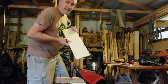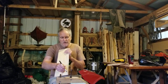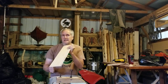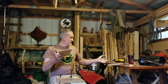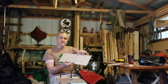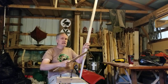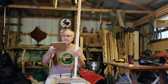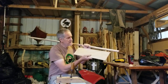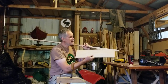Remove the strip and you have a nice smooth curve. If there are any kinks in it, clear them up after popping the nails out. Rough cut to the line, cut that out, and sight it and sand to refine that curve. You can also refine it once it's on the bow - sight down your bow to check for discrepancies. You can make handles, limbs, or anything using that method - just a thin piece of wood for the template and a thinner piece to bend between your nails.